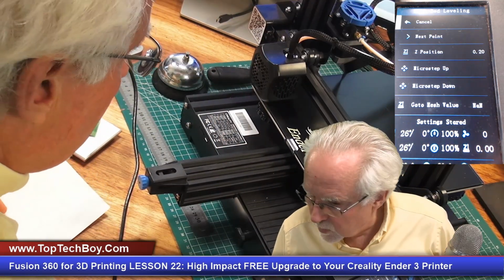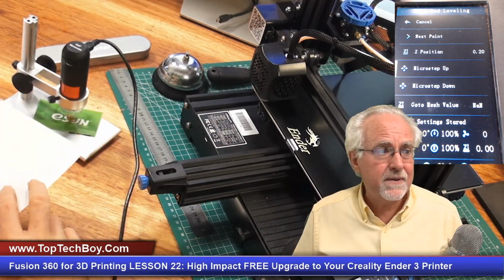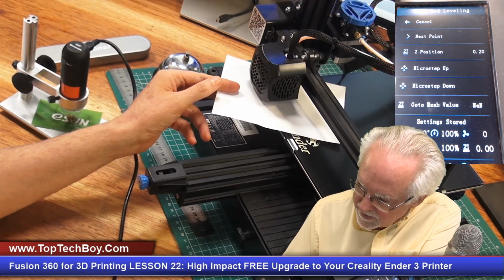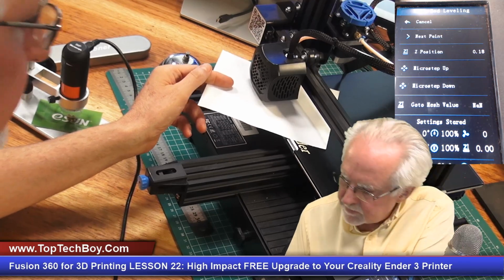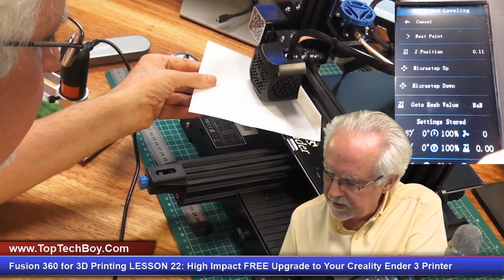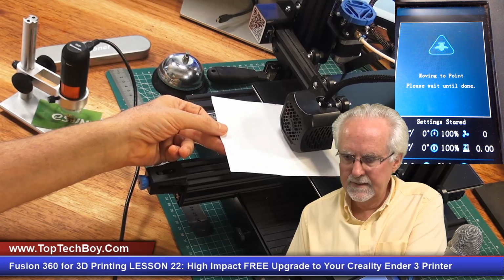So it tells us where we want to go. Okay, we are in the first position. And now you see, you don't touch the knobs under there. Don't touch the knobs under there. What you do is you come in with your paper, and that is too loose. So I'm going to micro step down. I want that Z-axis to come down. And it starts sort of far away. Okay, and there, I've come down, and that really feels good. Okay, that feels good. If it's too tight, you what? You micro step up.